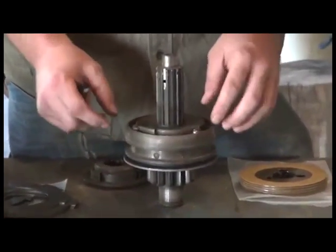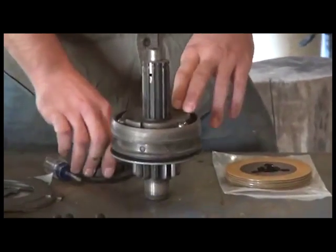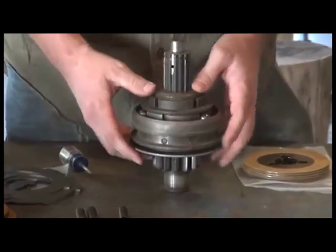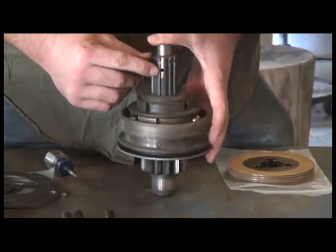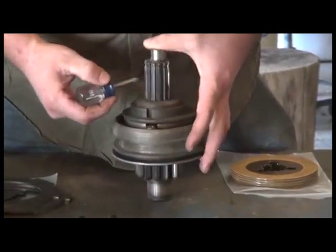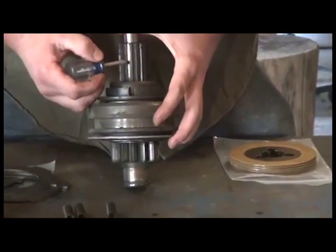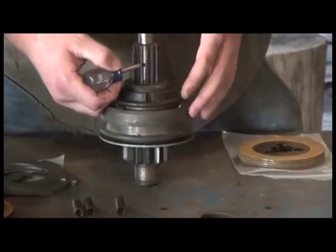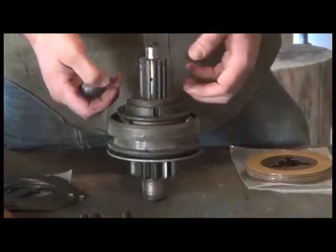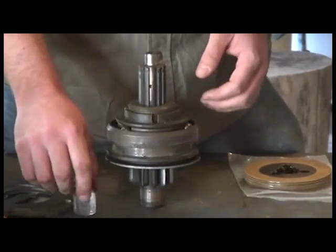Basically what I'm going to go over here is the assembly of the PTO clutch. After we've got the engagement ring, the collar, and the three balls on, which I think has been covered previously, go ahead and slide the adjusting collar down. And take note right here, as I was starting to explain in the previous segment, there are oil holes in the lands around, as I've got those marked in gold there. Oil actually flows from the PTO oil pump through here to keep the disc cool when it's disengaged, so it doesn't build up heat, and even while it's engaged, again, to dissipate the heat.